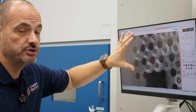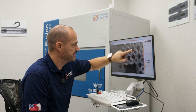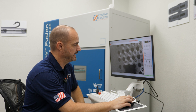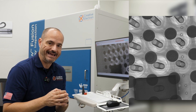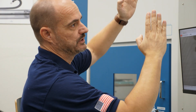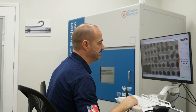Here's a 2D image of that same BGA — looking straight down at each one of the balls. You can see the circle, which is the edge of the ball once it collapsed, and inside a slightly lighter circle, which is the area on the PCB pad where the solder liquefied, landed, and solidified. Now I'm going to tilt the sensor to about 35–40 degrees, which allows a side view — the 2.5D perspective.